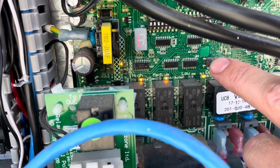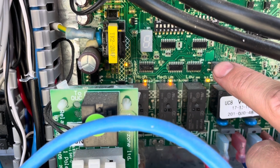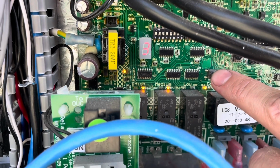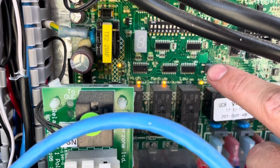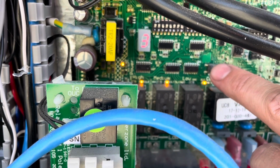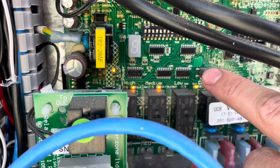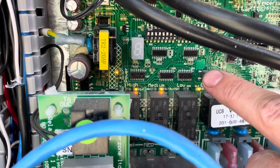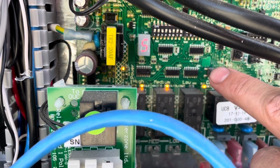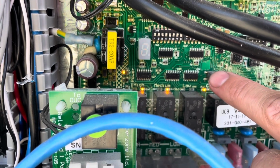So we'll go through. So SLP, 897 looks pretty good. Suction temp, 7 degrees again looks pretty good. Suction line temp, 13. Superheat, 6. Condensing pressure, it's pretty good. Condensing temp, 40 degrees. It's all looking pretty good on the first stage.